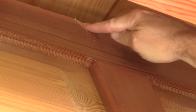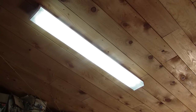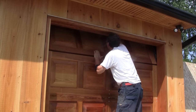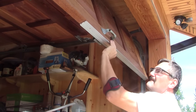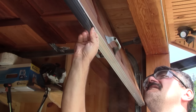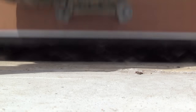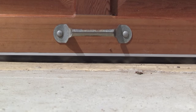I managed to damage the top of the door the first time we opened it. The door has a sealing fixture, which is the reason why I turned it 90 degrees from the other one. But now I have to add finish to the damaged wood. And I can install the garage door's bottom — after screwing the aluminum rails, we measure the rubber seal, cut it, and install it. Now nothing can pass underneath my door. It's well sealed.